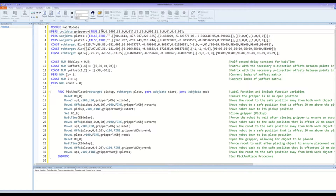These are things that we have defined within the robot using the teach pendant. This includes the tool data of the gripper, both work object frames — plate 1 and plate 2 — and the three robtargets we have defined: B1, A1, and a safe position. After that, for the rest of the code, everything will need to be manually programmed.